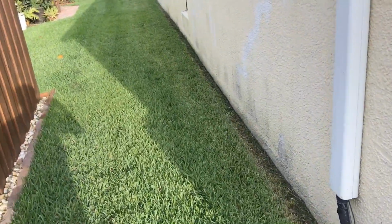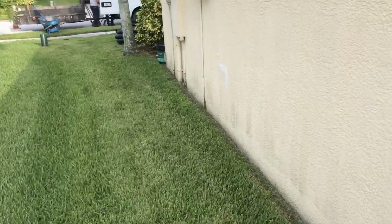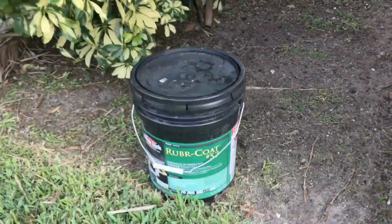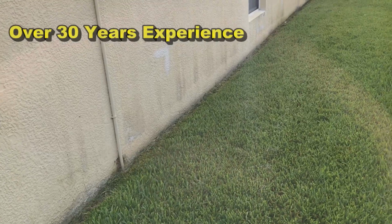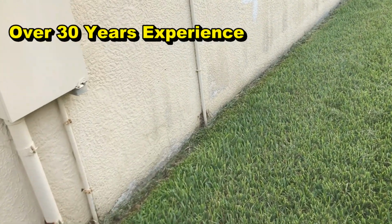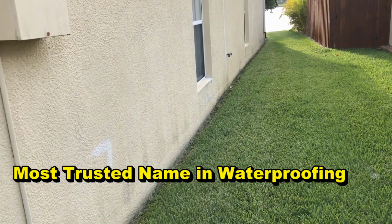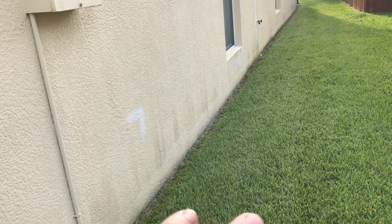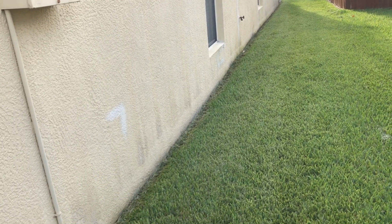Along this wall, standard issue stuff that we normally do, we're going to trench all down this whole entire foundation down to the footer level. And that's usually down there about a foot, 2 feet. Then we'll go ahead and excavate that, clean it off. We're going to put on our Blackjack number 57. That's our waterproofing compound. It's a damp proofing compound, but it does stop the water from entering that first course of block. Then we'll lay out our gravel and perforated pipe, which some people call a French drain. Remember, we call it a footer pipe because it sits at the footer. Go ahead and cover that. Basically, we're going to encase that entire system in fabric. We use a soil separator, then we backfill, and we're done.